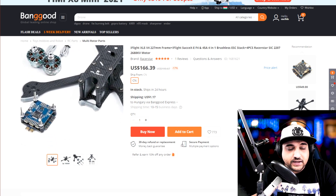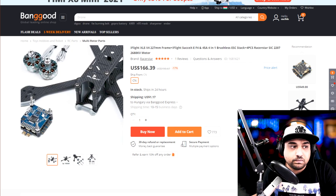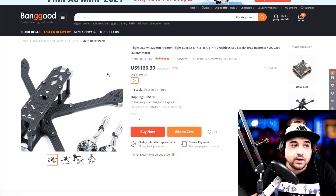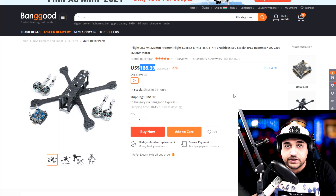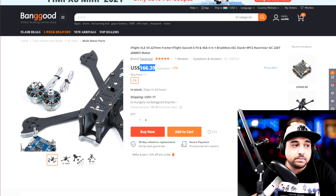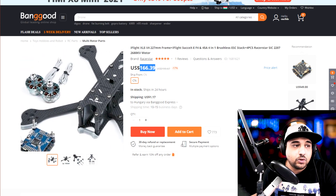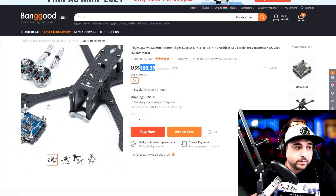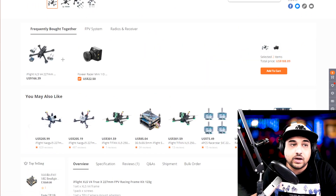This is a kit at a pretty decent price. However, it is using the old iFlight ESC which could cause problems depending on your setup — these are pretty power-hungry motors. I'd highly recommend you add a low ESR capacitor. With this kit you're still missing a receiver, a video transmitter, and a camera. The motors are really nice high KV four S motors — it'll be a screamer. With this ESC I'd highly recommend adding a low ESR capacitor so you don't get any weird twitches or jitters.